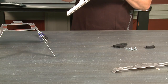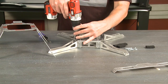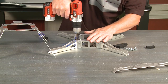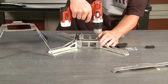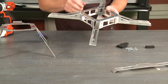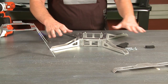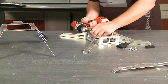You don't want to tighten them all the way down until you get everything in there. Now all of them are in there, and this is the fun part, because we get to go through and just screw them on with a gun. We'll go ahead and screw this bottom plate on first. I've got my drill set at seven right now — that's pretty good — and you want to push down real hard so you don't strip out that screw. Seven might be a little bit different on yours. These are locking pins on the back side, so what you're screwing into has a lock on it, making it really hard to back those back out after you get them in. We're going to lay this flat and screw in all the arms.